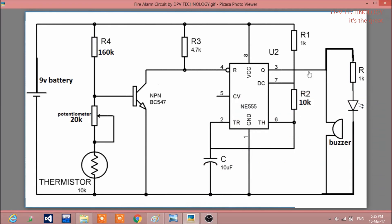When R is connected to GND, the output is off — the LED will not blink and the buzzer will not produce any sound. Now for the second case: when we are heating the thermistor, the resistance decreases, and the current to the base terminal decreases automatically, so the transistor will be off. If the transistor is off, the reset pin is not connected to GND. The current will come through the resistor to this reset pin, applying a high voltage, and since it is connected to VCC voltage, the output will be in astable mode and we will get the buzzer and LED working.